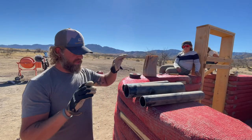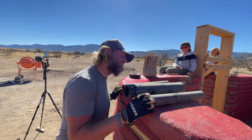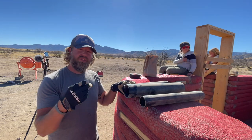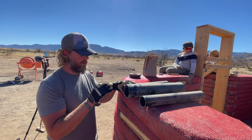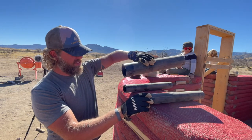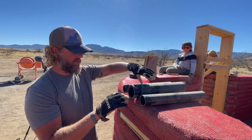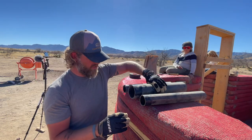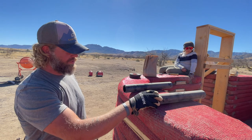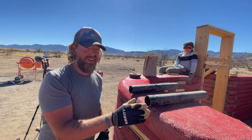So what we decided to do is go ahead and put PVC sleeves in. These are three inches — and then we're going to be putting two inch pipe and one and a half inch pipe through these respectively. We decided though to go up a level with this, so with the LB connection we've got plenty of room and we're not all getting in the way of each other. So we're going to take this one out for now. We'll tape these down to make sure they're roughly in the right spot and they don't move, because they keep wanting to shift. Then we'll just lay the bag right over top of it.